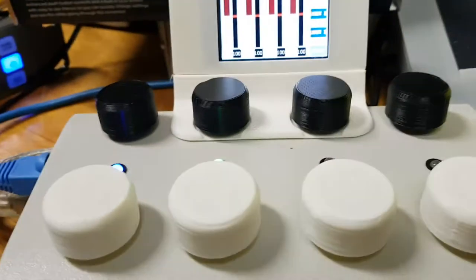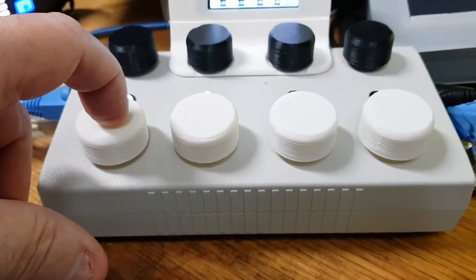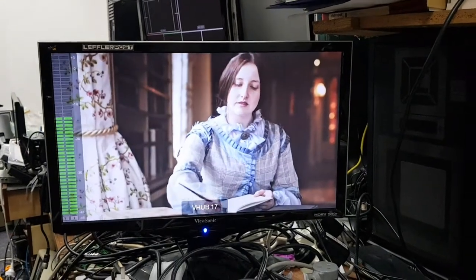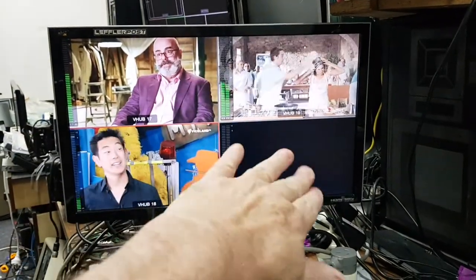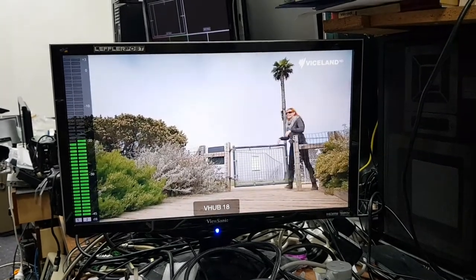The purpose of this video is to show you the interface to the Multiview 4. The way I've got this set up is in toggle mode — which I'll show you in a moment. What you do is push the preview button for camera 1 or camera 2 — these cameras are allocated as well — and you'll see as I'm selecting each one it switches the monitor over to what they call solo mode. So you can press and hold to look at each camera. There are the four cameras, and when you take your finger off it goes back to the quad. None of these sources are locked to each other — they're all just off-air feeds. If you've got four cameras that are genlocked you won't get any black flashing at all; they'll clean-switch between each camera. Even with these unlocked, the recovery time impressed me quite a bit.